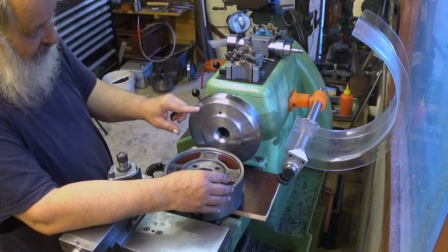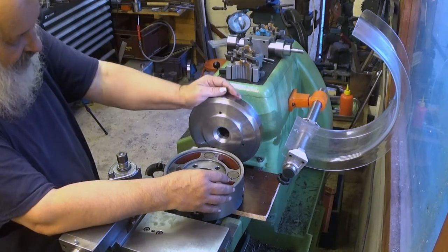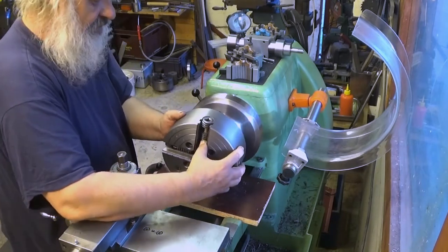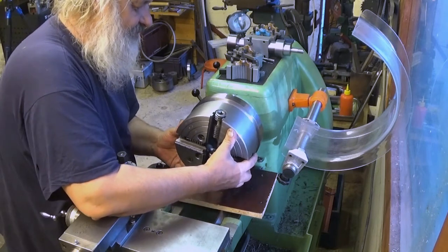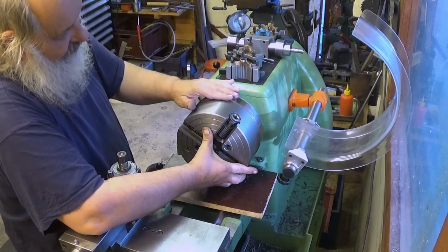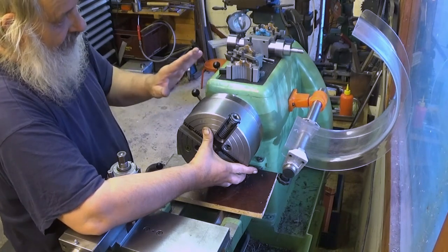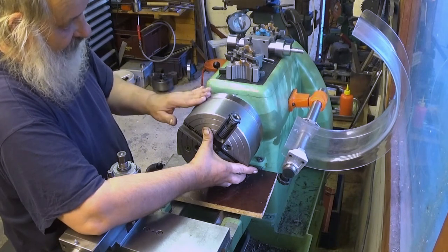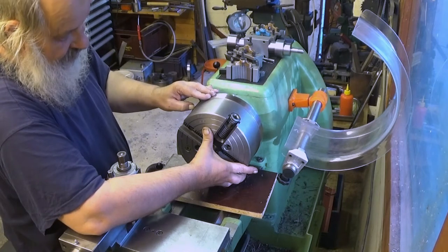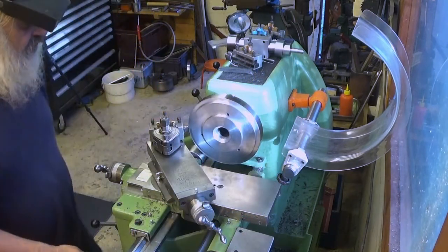Okay. And we need to chamfer this. Not a lot, just a little, not to hurt myself. And then we need to chamfer this one as well. And this one should be a little bit bigger chamfer. When I put the chuck into there, this is sort of heavy, this chuck. You can see that it's hanging over here. So I will actually make a 5 millimeter chamfer there, so then it's more beautiful. It's just a matter of looks. It has no functionality whatsoever, and yeah. It makes it easier to clean it up. It doesn't collect the dust into there so much. So, okay. Well, let's do the chamfers now. That one is the usable.